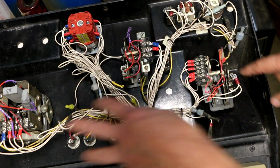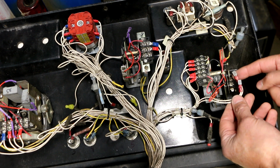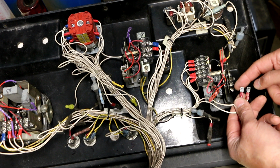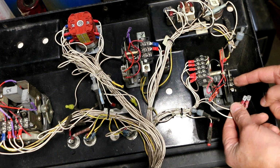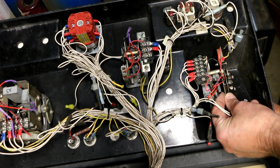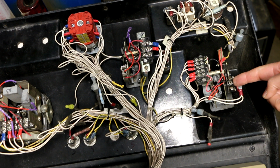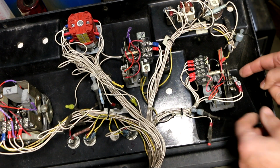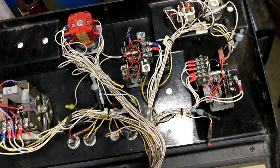But unlike the other units, this one has this extra switch right here, this micro switch, which I just disconnected. These 2 wires right here actually go down to the system, and they're attached to this micro switch that gets closed anytime this control is moved forward or backwards. And what this switch does, according to the schematic diagram, is this is the throttle up. So when this switch closes, it should send the signal to tell the engine to throttle up because you want to move. So apparently it needs a lot more power to drive all the hydraulic motors involved with moving the unit.